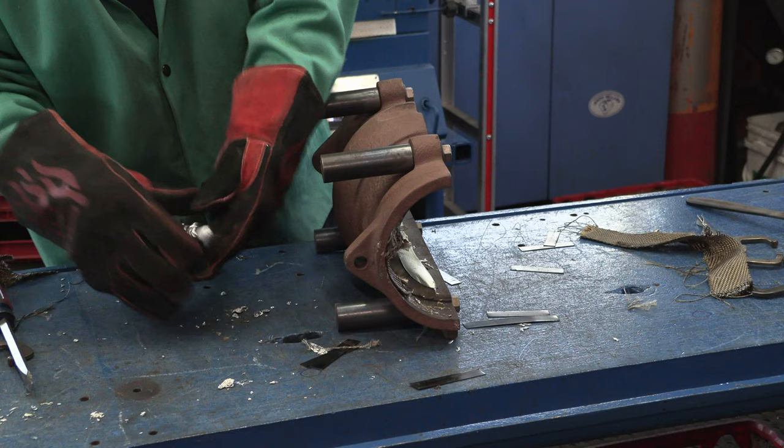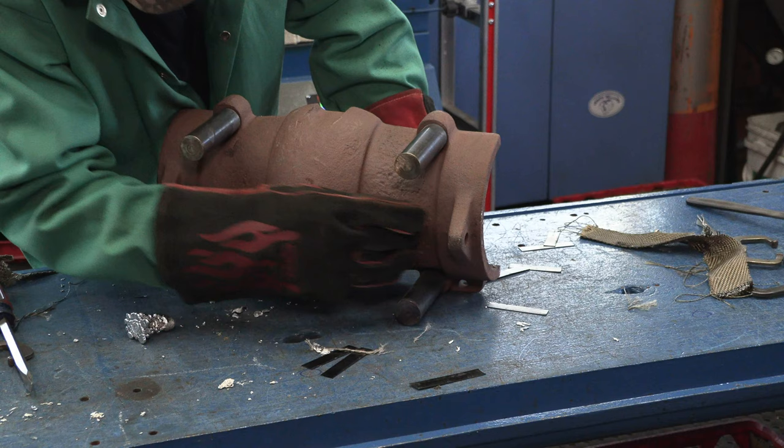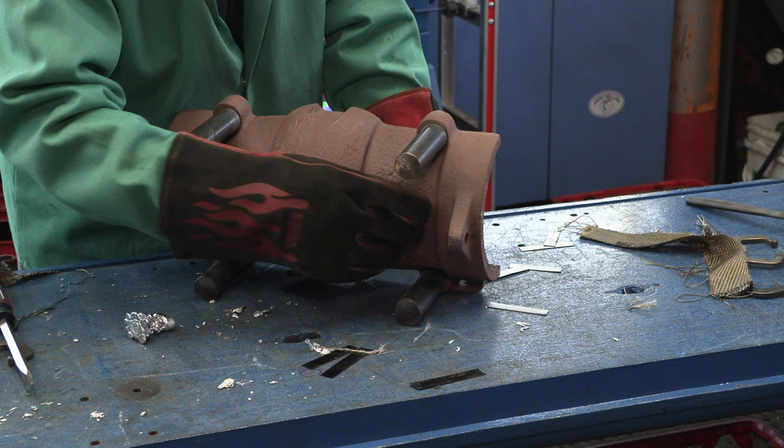And you can't even really see the hole, but you can see a little tiny dab of Babbitt right there. That's a drill point from one of my drills. That's how close we're wearing into that area right there. Okay, so I'm going to touch that up so that it won't leak.